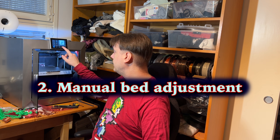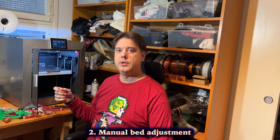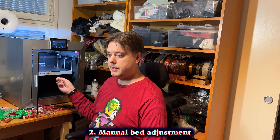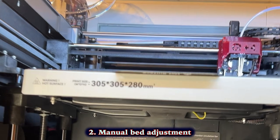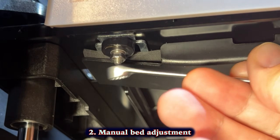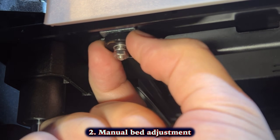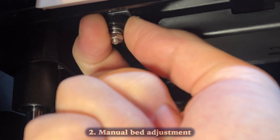There's an option in the tool menu for platform reset that guides you through adjusting the nuts below the bed with a seven millimeter key. The problem is that the nuts you adjust with this don't actually do anything — they just secure the actual adjustment piece in place. How the process actually works is that you loosen the nuts and then adjust the black plastic round piece above it, and that is what makes the adjustment.